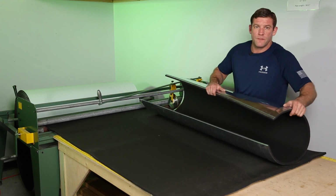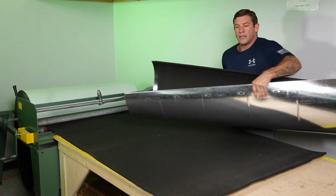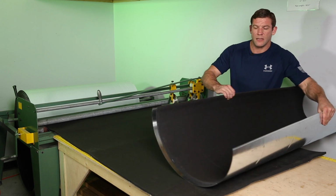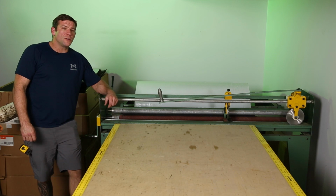So there is a male and a female when it comes to insulating with Armaflex. So this is our male side, and as you can see here, this is our female side, with no insulation on it. When we connect the two together, we're going to have a tight joint with our insulation right here. So we're doing round pipe.